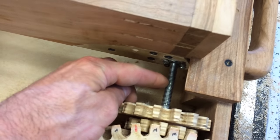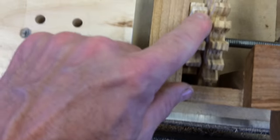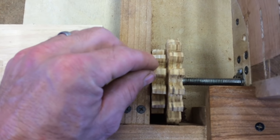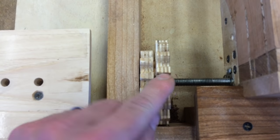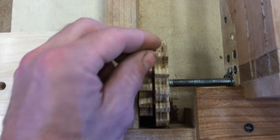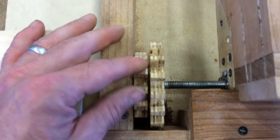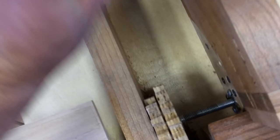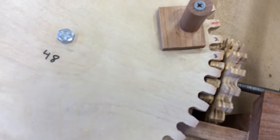The basic idea is this: the rod has 16 threads per inch — it's a standard 3/8 coarse thread — which means for every one turn of that thread, the carriage moves one sixteenth of an inch. The two gears mounted on that rod: this is a 12-tooth gear, so for every tooth the rod turns one twelfth of a turn. This is a 16-tooth gear, so every tooth is one sixteenth of a turn. You're breaking that rod's one-sixteenth-inch-per-turn into increments of 12 and 16 depending on which gear you want to mesh with.